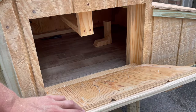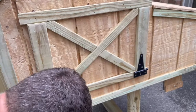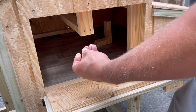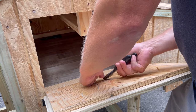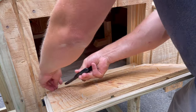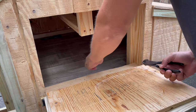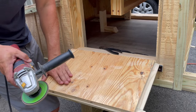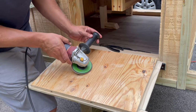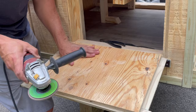In this shot there were a little bit of nails poking through to the back, and first I snipped those off. Then in the next shot I take the angle grinder with a flap disc and buzz off all those little pieces that are still poking out just a little bit. Make sure that your sparks are going away from your linoleum - you want to make sure it doesn't burn a hole in that.